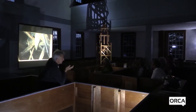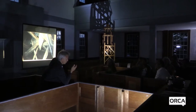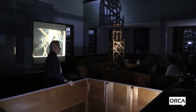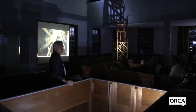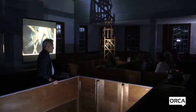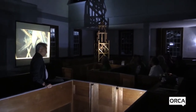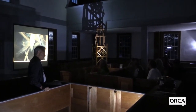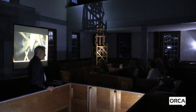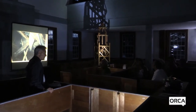But when you do this sort of work or painting, the problem is painters like to get done fast and they don't want to suddenly stop for a new problem they find. But it's wise to redo your flashings periodically at those points where you know it's leaking. Right now, I didn't find any water up in the steeple itself, and it's been certainly wet enough to leak, if it wanted to leak right now.